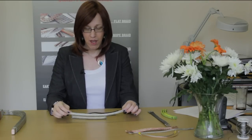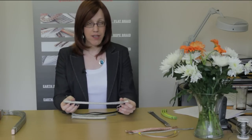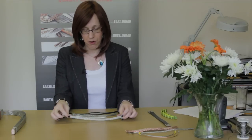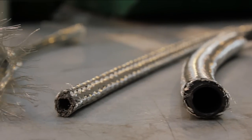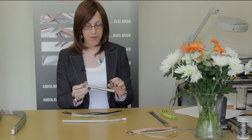I have some here in front of me. We do a shielding braid like this, which although it looks steel, it's actually a tin plated copper wire that's been braided onto a former, which you can see more clearly here on this larger version. There's the plastic former. This is typically used to protect instrumentation and data cables from the effects of EMC and RF interference.